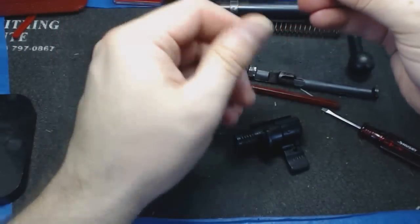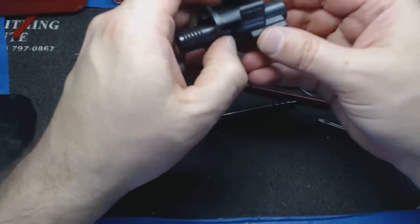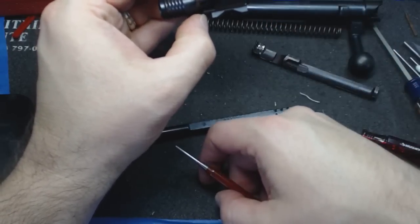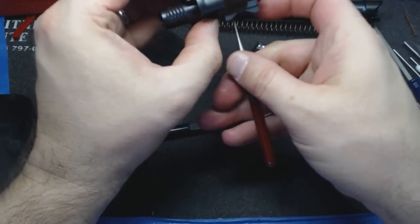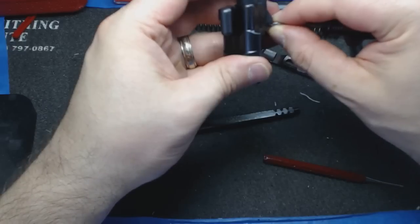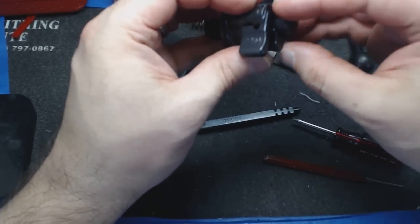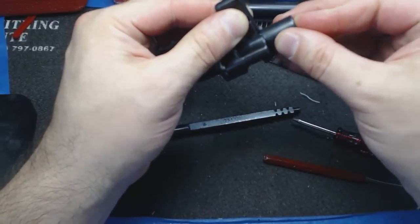The spring is pushing on this part, but not back here — the spring is being held between this piece and the front of the firing pin. So this piece isn't actually under spring tension; it's just an extension of the rest. The spring is pushing this part forward really hard, so as soon as anything is free, this whole piece will want to come forward. In the fire position, when you pull the trigger the sear is up here blocking this from coming forward. When you pull the trigger you're pulling the sear down and out of the way, which lets it come forward. All of that massive spring tension is held up because the trigger has a piece sticking up in the way — you pull the trigger and now it can go forward and go bang.